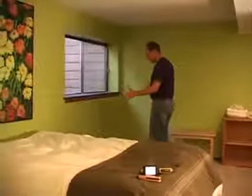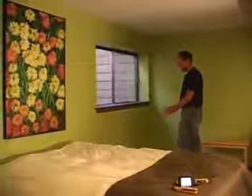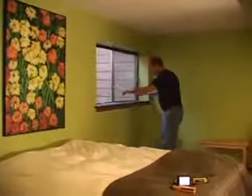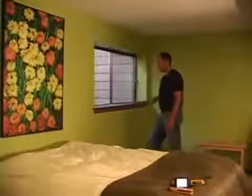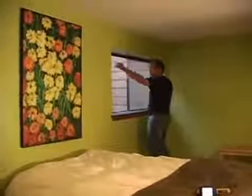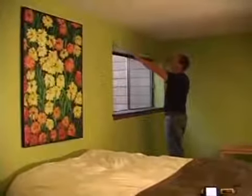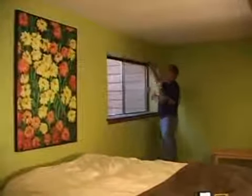The window well is a great place for a moisture inspection. There are really three places you want to look: below the window frame, because water can collect and if it's not draining properly outside the window well, it'll come in into the basement. The second place is here where the window frame is — the bottom corner sometimes collects water. And then there could be a flashing problem up on the top where the header is, so that area here sometimes collects water too.